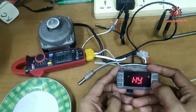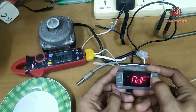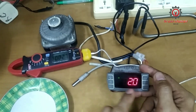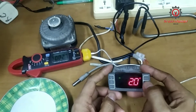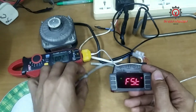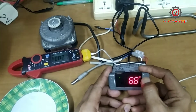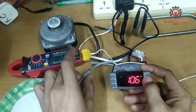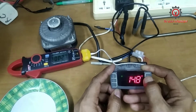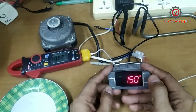Now let's locate the fan parameter — FST, Fan Stop Temperature. We're going to set that one. The default is two degrees Celsius. In order to activate the fan motor quickly for a chiller, you should increase this value. Let's set it to 15 degrees Celsius so the fan motor will activate right away. If you're using a freezer, two degrees Celsius is fine. Let's save that.